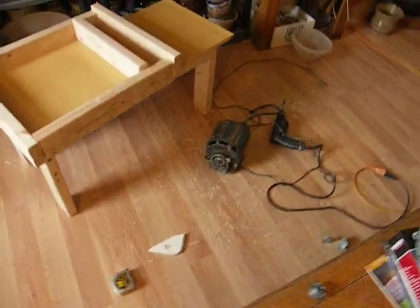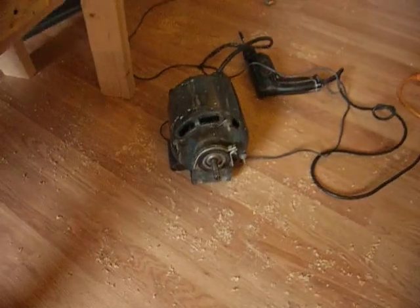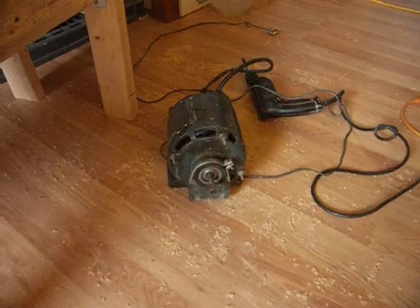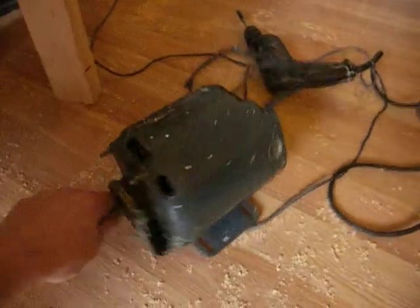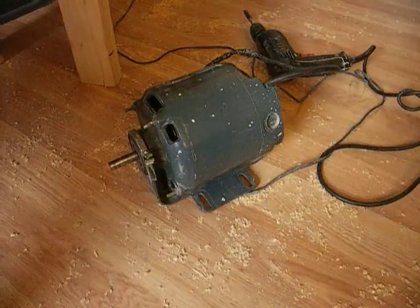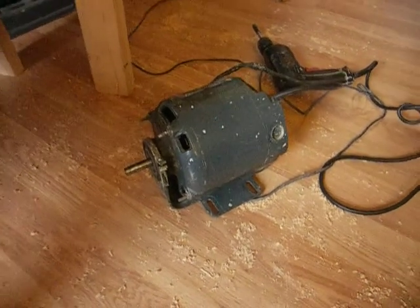Here I've got a couple of hinges. Over here, we went ahead and picked up an AC motor for about $10 at a garage sale, surplus store, or any kind of junkyard — they're pretty easy to come by. I think it's three-quarters of a horsepower, 1,700 RPMs. You don't really want anything going faster than that.